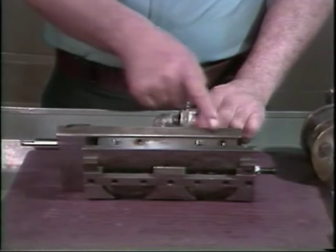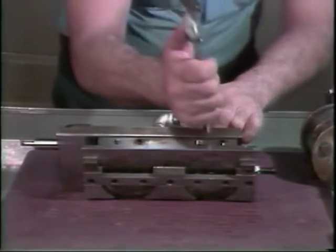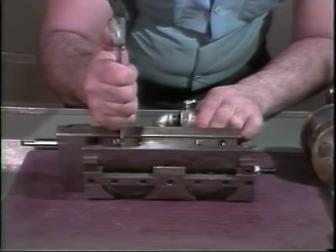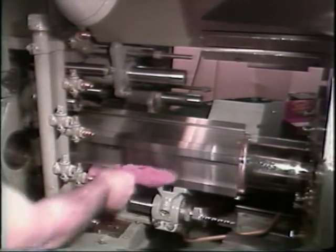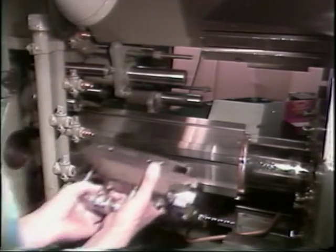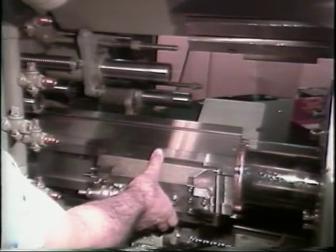These surfaces must be parallel after the adjustment of side travel. To be sure the sides are parallel, measure with a caliper. Now you can mount the attachment to the machine. Remove all dirt and chips from the attachment base and tool slide surfaces. Mount the attachment base to the tool slide. Use the required number of holding bolts. Do not fully tighten these bolts at this time.